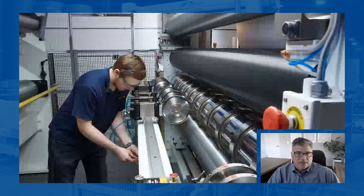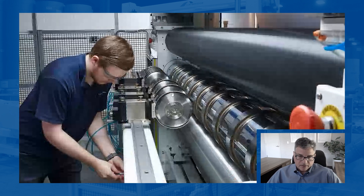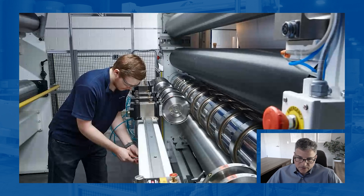This photograph is a CAT bridge surface winder. The machine goes 6,000 feet a minute and it has shear knives. When we talk about shear knives, we have a male knife, which is this holder right here, and we have a female, which are these rings on the shaft. These are precisely set with an auto positioner or by hand, depending on the machine capabilities, and these really set the tolerance.